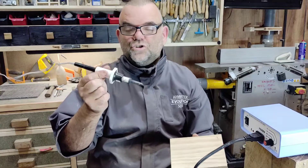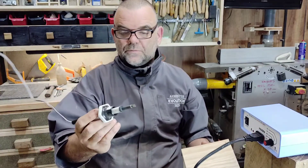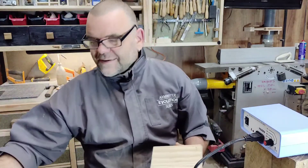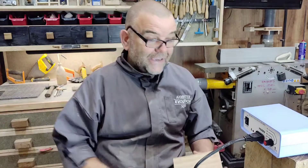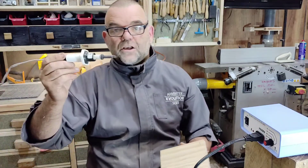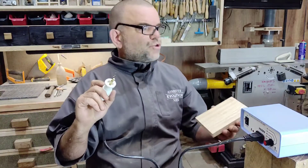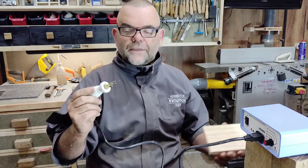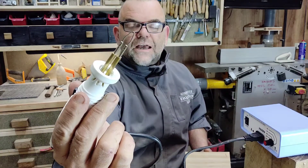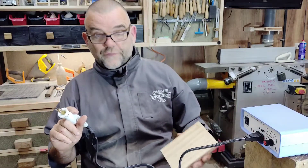There's only about 30 watts of power in that particular pen — pyrography pen, wood burning pen, whatever you like to call it. But that's been relegated now because I've got this little device here and it works on a different principle. The old one is a bit like a soldering iron — it heats up the tip. This one has almost a hot wire, like what you'd use for cutting polystyrene blocks. There's a wire in between two electrodes, and it puts a current through it and heats up really quickly at relatively low wattage.